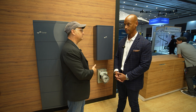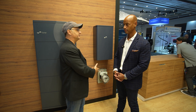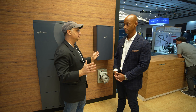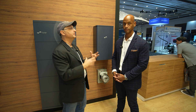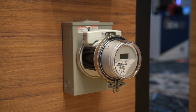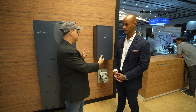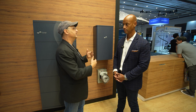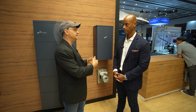One of the things that sets our product apart — because there are other islanding adapters out there, Tesla has one, Enphase has one — our mission has always been to be as broad and vendor agnostic as we can. For our original solar product, we designed it to work with any 1741-capable inverter. For our EV product, we don't have any data interface between the EV charger and our product — it does all the work itself, you can plug any EV charger into it. For our Islander, we do have a data protocol, which is analog, that each partner we work with integrates to. But we kept that integration very open and we're willing to work with a whole variety of partners to be the non-proprietary solution for everybody else.